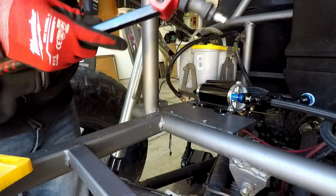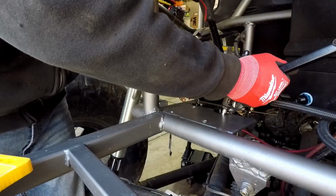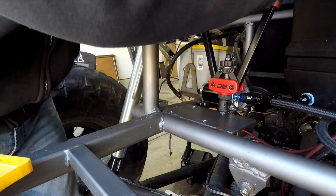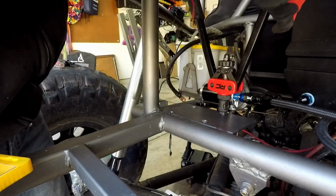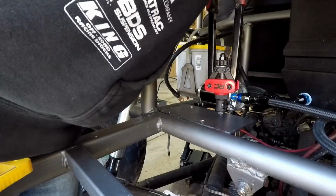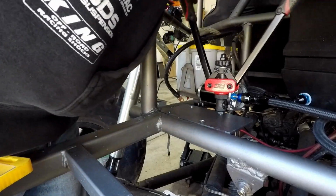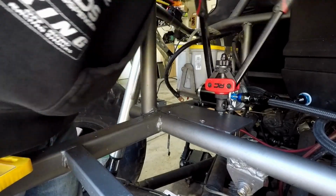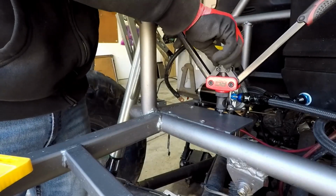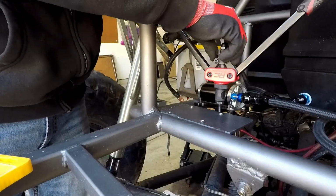I have done millions of these things when I owned an off-road business. You want to make sure you get it in there. This tool is actually a little bit bent, but it'll work. Put it in there, and you're going to need to use a little bit of manpower here. You crush it a few times. Okay, and then turn this slightly. You can over crush these. Alright. This unscrews. And I'll put the link to this tool. It's been amazing. This one's a little bent, it's been abused.